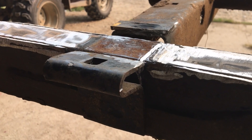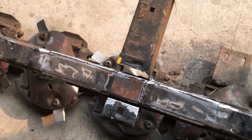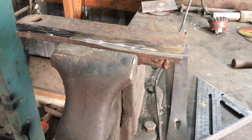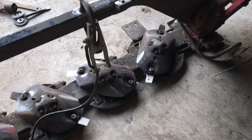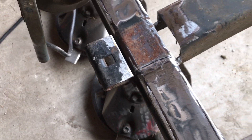So we'll at least be able to put weld onto the original piece of tubular. We're gonna work again for a while. Since I don't have the right material or a plasma cutter, we get to do it the old-fashioned way — making a piece of two-inch flat iron out of three-eighths stock. Well, it ought to be strong enough. We had it all rigged up and ready to weld, but we stretched out the weld cord and didn't have enough reach, and we'd blocked in the shop so we couldn't get the loader. We had to move the tools and rejig it, but I think we're ready to do the initial deep penetration weld on the beam itself.